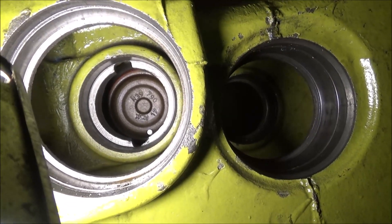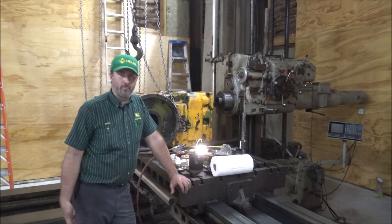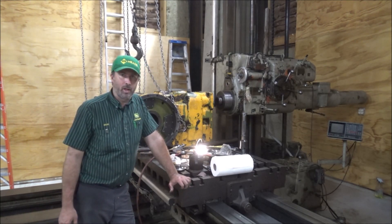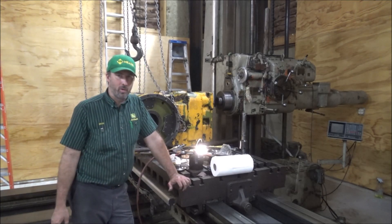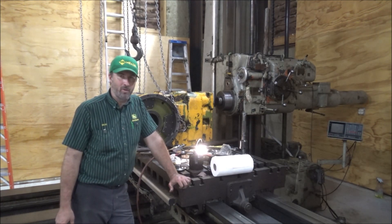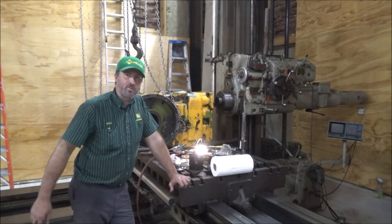I'm going to call this job done. That's the first bigger job completed on the G&L. Could have gone better, could have not had to do it over, but it's turned out alright now. Practice makes perfect - still got to get more use to run this machine and the tooling on it, and getting the tooling tuned up. I need to get a bunch of half-inch high-speed steel blanks that I can grind out and make cutters with, because most of these ones that come with this tooling are all shot and I've had to re-grind and touch them up to get it to work. But it's working okay. Thanks for watching, thanks for subscribing. I'll catch y'all later.